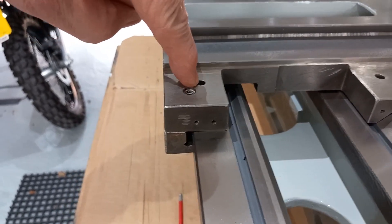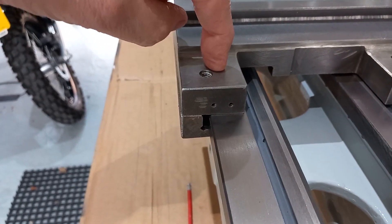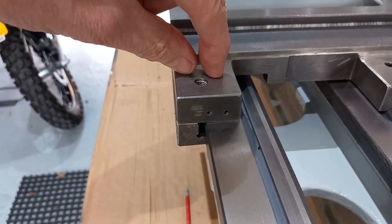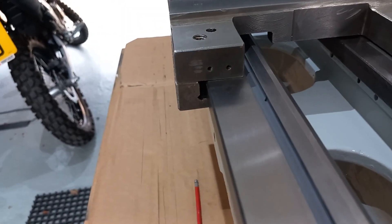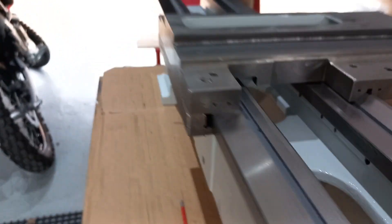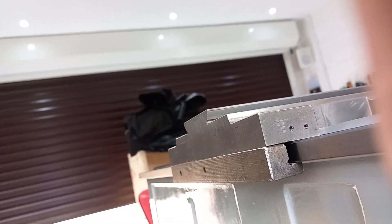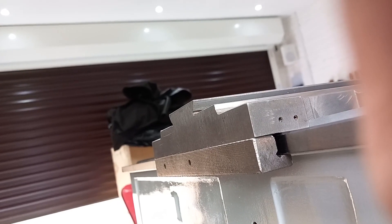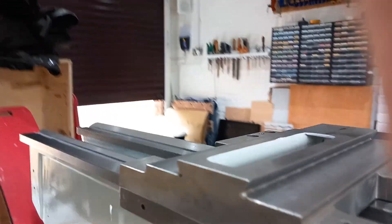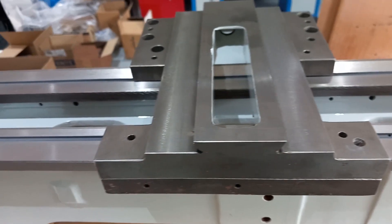That's supported by the fact that the holes for the oilers are also about an eighth off center. That gap is way too big, and the amount of land on the underside of the keeper is not even an eighth of an inch — hardly any support there at all. And that's apart from the fact that it's loose, which is not good for stability.